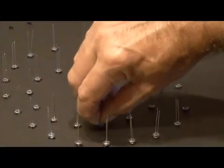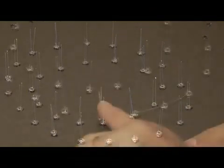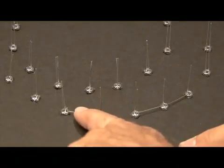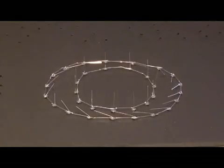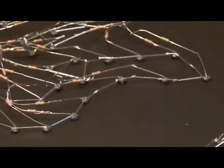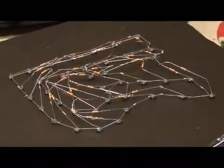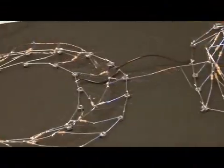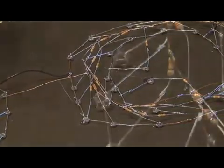It's time for those LEDs, as one will go in each hole in every letter of your sign. This is probably the most time-consuming part of the project, as each negative connection of the LEDs needs to be connected together. Then a 330-ohm resistor needs to be attached to each positive end of the LEDs, and then all those positive ends need to be connected together. Join the positive and negative ends of each letter together as you want those grouped.